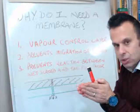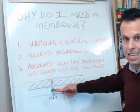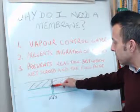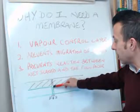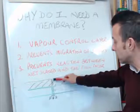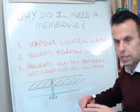The insulation allows the screed into those joints, and what you'll get is really twofold. First, you'll get a pathway for heat loss — you're not going to benefit from the heat loss resistance there. The other thing is that you potentially won't have a solid base, and at that point you may get some mirror cracking. If the joint isn't tightly butted and the boards separate, you may over time, with some movement, actually get cracking in the screed.